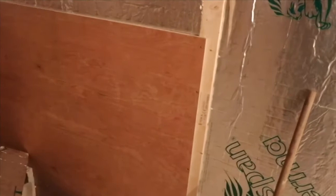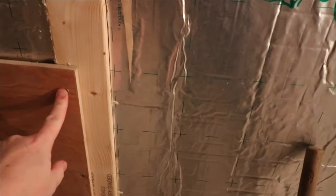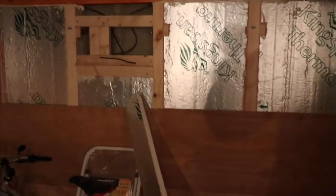So as you can see, I've attached plywood to the walls, going around the garage. What's key for attaching them to the actual wooden columns that I've put up, the battens, is making sure there's space in between. So I've left a little bit of room there to attach another one to the other side, and I've done that more or less all the way around, putting about 10 screws down the center of the battens, and also fitting them on here as I have here. Here's one, and it's just a matter of giving it an extra layer of insulation.